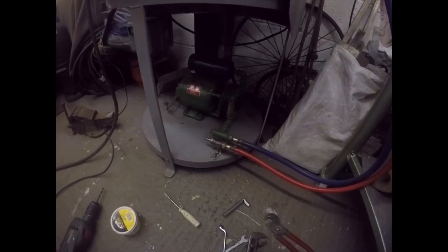I need to fill quite a large gap with brass, so that if I mill it down and it's getting close to the break-through point it won't matter. This also gives me a quick, very hot flame to heat things up with. At the moment I've got no oxygen set up — although I have the bottles and gear — so this is a very quick stopgap for heating stuff up, especially when the forge is not lit, which is most of the time. You wouldn't want to light the forge just to heat something you could do with this. That's Monday done.